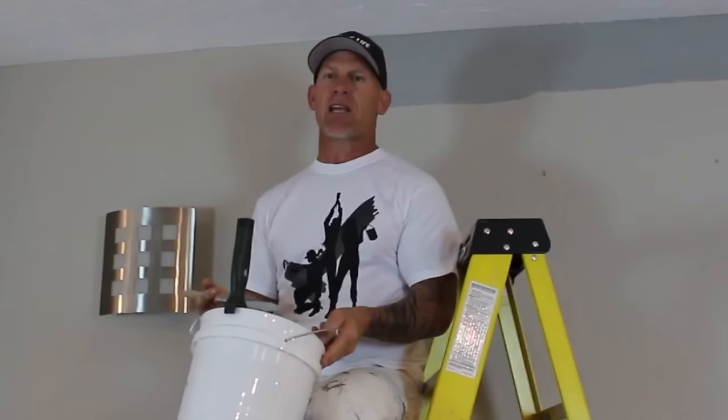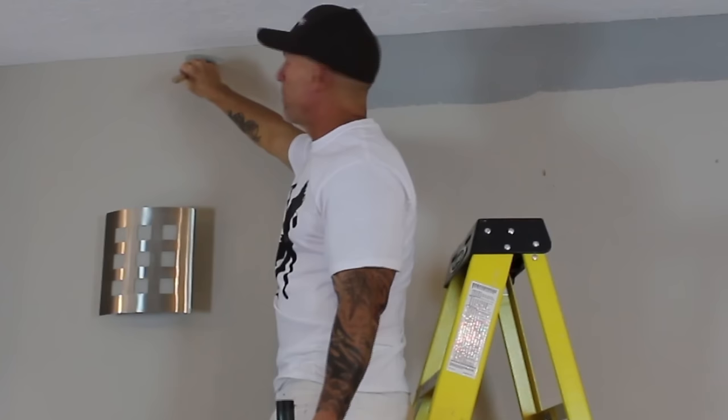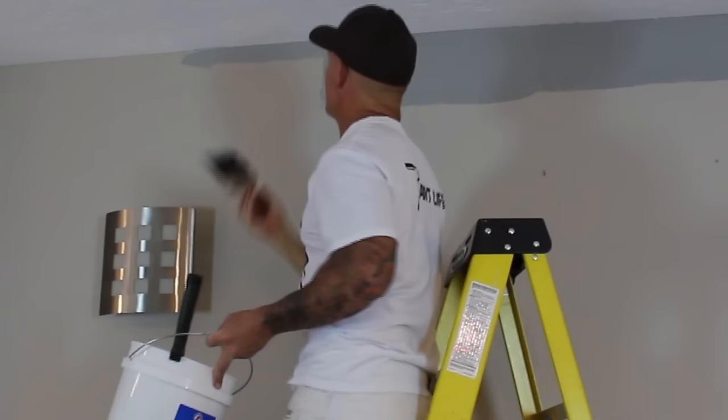Let me give you one last demonstration. I'm going to dip my brush into the paint, pat it on the sides to make sure the brush is loaded up, carry it to where I'm going, get it about an inch or so from my cut-in area, and then work up to the cut-in. Glide it right along my ceiling — it'll go about a foot or so before it starts to run out of paint — then take and cut it back in the opposite direction.